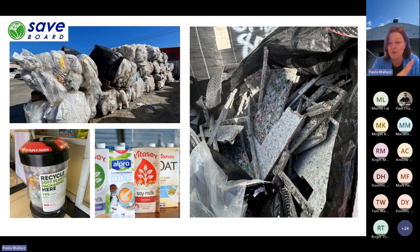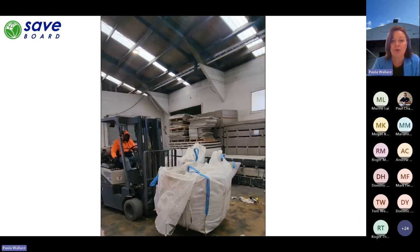So what I'm going to show you next is what we do with these raw materials. This is a short video and I'm going to talk you through it. So we weigh the raw materials like a recipe. What we've got going on here is returned construction waste, and you will recognise that as a pallet wrap around the timber. So that gets then thrown into a ginormous shredder and shredded into small particles, which are then fed through a hopper and measured out into this 100mm fluffy bed of raw material.